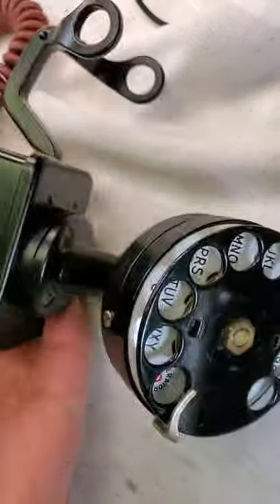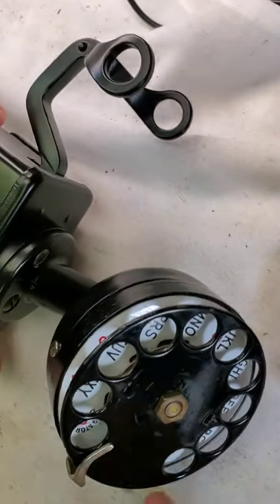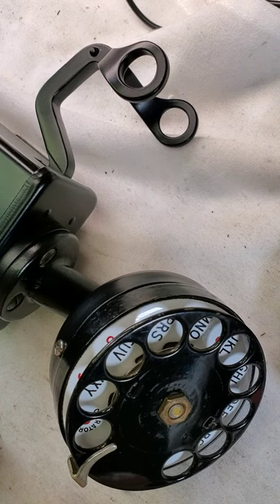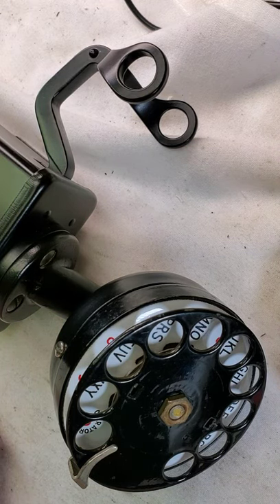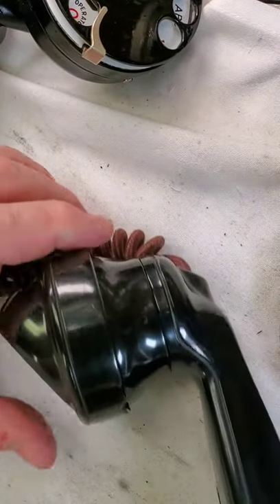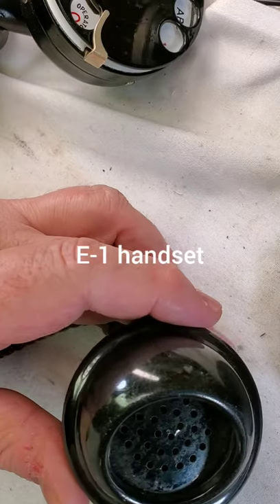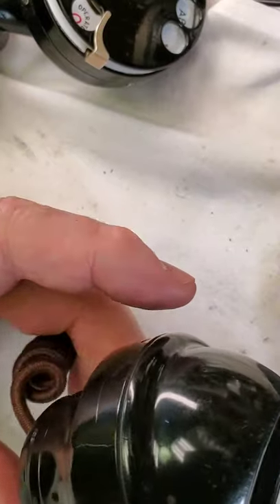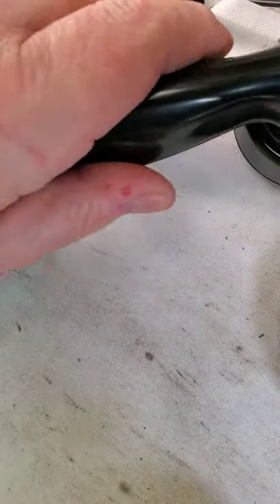This is a beautiful, beautiful phone. So that's how you do a 5H dial — 4H dial, same thing; 2 dial, same thing. The only difference is you may have a washer in the middle, but the basics are the same. Grease on gears, oil on pivots and bushings. Grease on anything that moves. The synthetic grease is the way to go — it won't interact with anything. I hope you got something out of this video. Here, I'll show you the handset — it's got the early E1 handset. Look at the condition of this thing; it's beautiful. It's got a little crap in there, but this was probably never used — there's no ear residue, it's nice and clean, just gunk from sitting around. Beautiful piece; it's got the seam, doesn't even have to be polished. All right, that's that.